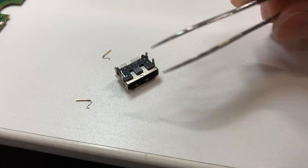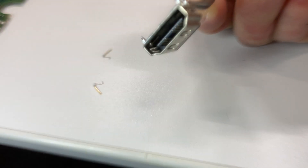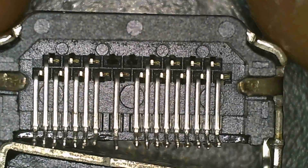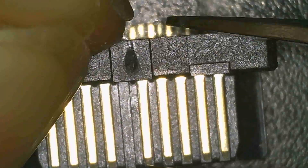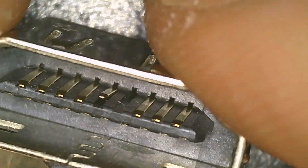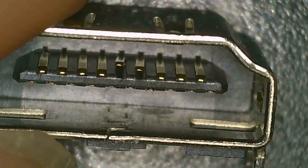So I look at my broken HDMI port and the fallen pins to see what I can do with them. Then I came up with an idea — maybe I can put the fallen pins back. I have a total of 4 missing pins in the broken HDMI port. Even after putting 2 pins back, there are still 2 missing. So I started messing around to see if I can transfer pins from the new HDMI port to the broken one. The answer is yes — I can simply push the pins out and transfer them. However, the new pins are larger than the original, so it doesn't quite fit and I have a hard time inserting them. With some trial and error and adjustment, I made it into an acceptable state.